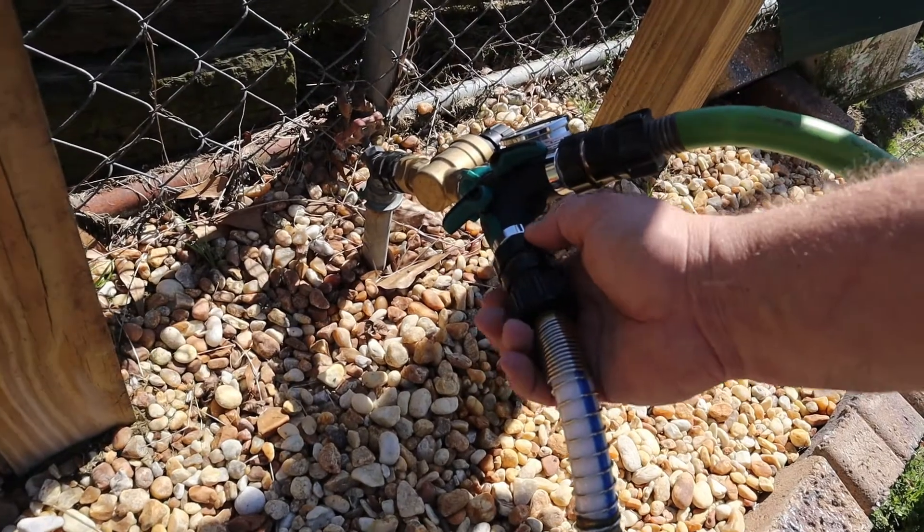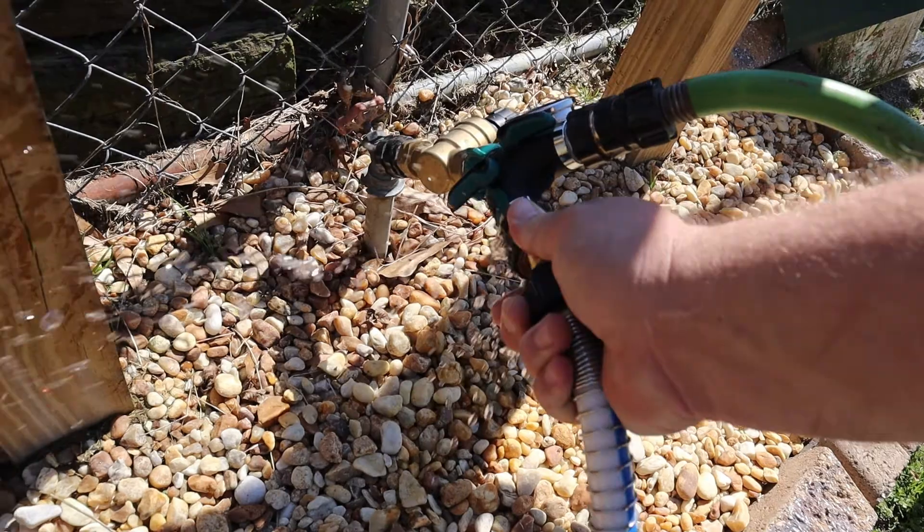Ours we do not — we just have to remove the drain plug and let it drain out. The first thing you want to do when preparing to work on your water heater is make sure it's off, both electric and gas, and give it ample time to cool down — you don't want to burn yourself. We've had our water heater off since last night, so it's been well over 15 hours. Also make sure your water supply is cut off — city water or water pump — because you don't want to open this thing up and have running water coming out.